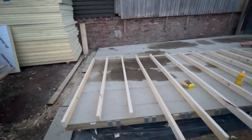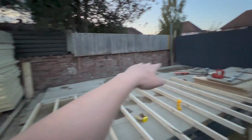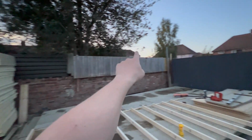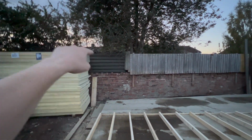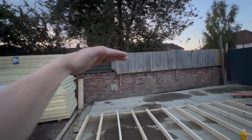So what I've done, because I've got 3.4 meters there, I've got 4.1 meters over there, and then I've also got a slant going across the back. Instead of doing level wall across, and level wall across, I'm doing a sloped wall down there, a sloped wall down there, and then my back wall will slope to take the pitch of the roof correctly, so it's all flat through.